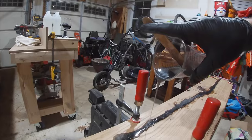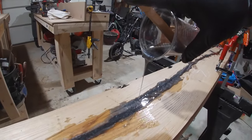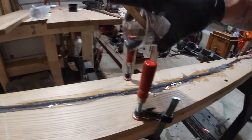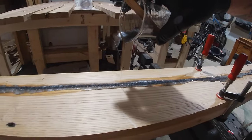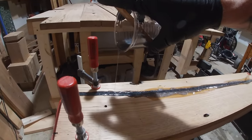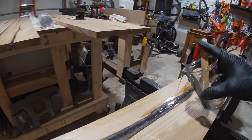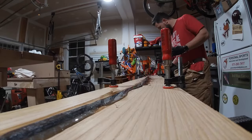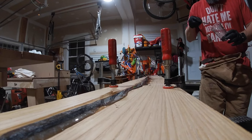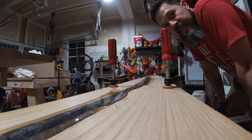Oh, this is cool — look at that. It's definitely got more of a silver look. This one's nice and full over here. Make sure all the little nooks and crannies get some. I think it's looking pretty good — it's like a bottomless pit though, must go deep into the wood. These little pores are satisfying to watch filling in. I'm convinced that's why so many people get views on YouTube — they post stuff that's so satisfying to watch. I think that is full. It's so full it's going to flow everywhere, so I'll leave it. I can scrape or use a plane to level the top edge before sanding.